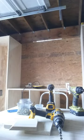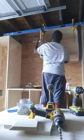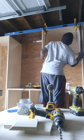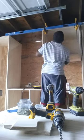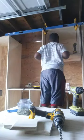Welcome back. We're here with a couple tips on how to install some upper cabinets — a couple different methods. One that I like to use: you could attach a cleat on the wall, but in this case I don't want to have any holes down below where you'll see it, so I like to actually attach a board or a level — any type of straight edge — to the top side of my cabinets.